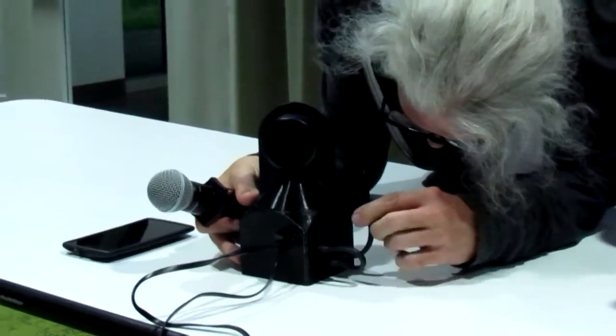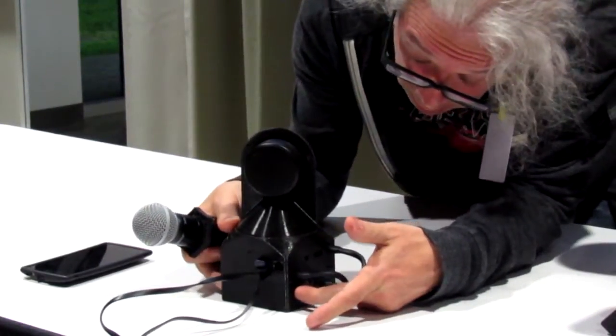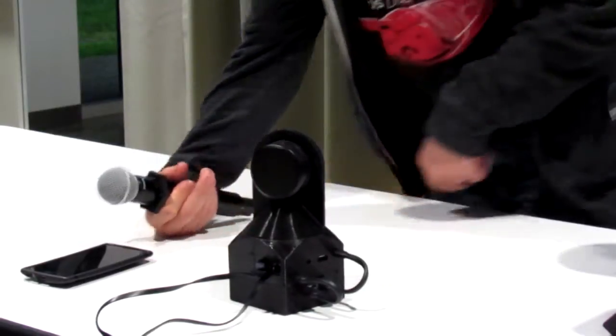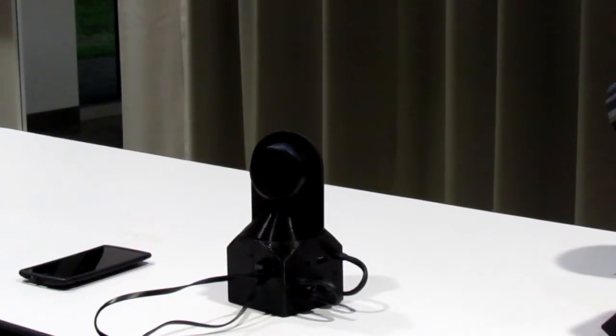So, it's all pretty cool because it uses USB power from a big, charge your iPhone 50 times kind of battery bank, and there's a Wi-Fi thing on it, and there's a level, so you can make sure that it's level. It has a BNO055 IMU on it, so you can tell if it's level, or if you wanted to take multiple scans of a space, you can move it and tell how far you moved it. It's all open source. I'm adding a GPS to it so that you could match the scans up.